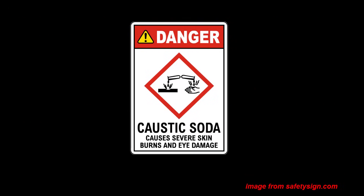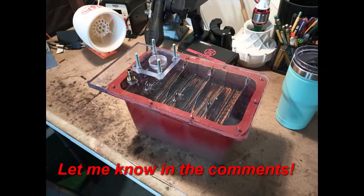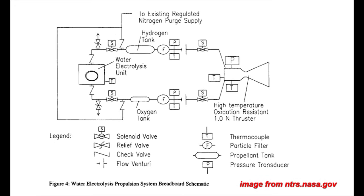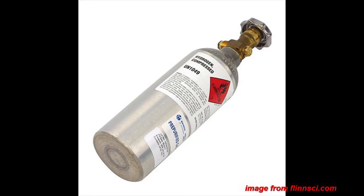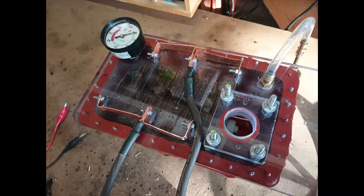To actually achieve supersonic flow and better performance, I would need to improve both the efficiency and power capabilities of my system, and use a better hydroxide-based electrolyte with the right precautions. Running at higher pressure is also important, which would warrant a full redesign — possibly the topic of an upcoming video. A system such as this has niche applications, for example as a means to propel a space probe between icy asteroids, where it can refuel using stored solar power. Hydrogen fuel is very versatile, and a next generation of this setup could power anything from rotating detonation engines to high-impulse arc jets and MPD thrusters that rely on the light gas nature of hydrogen. I plan to continue development to eventually unlock its full potential and overcome even more of the design challenges.